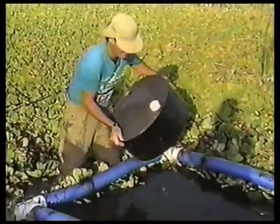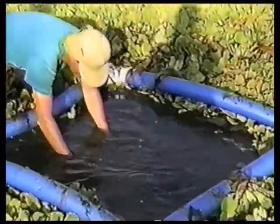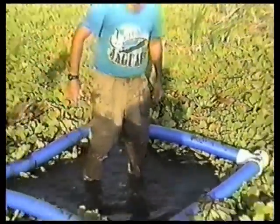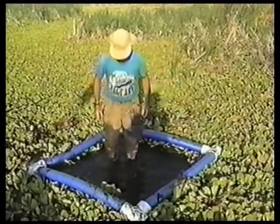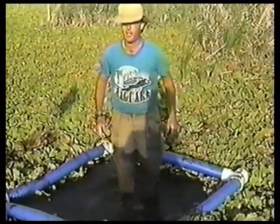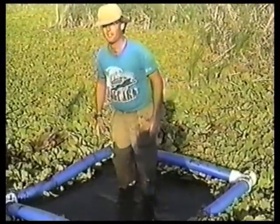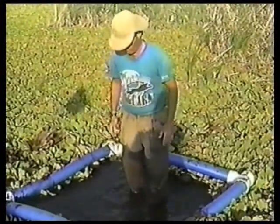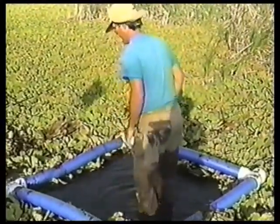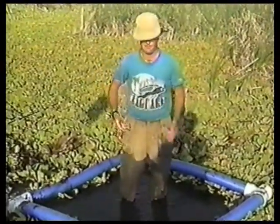Now that I've cleaned all this out, place that in the center and proceed to push it down. Normally the water's about this high and we use a garbage can to fill with water on top of a stand to push the meter down. The steel edge is thin enough and sharp enough. The water's shallow enough that my weight's sufficient to move around and push it down. We keep the outlet slanted so any gas produced in the meter will come on through.